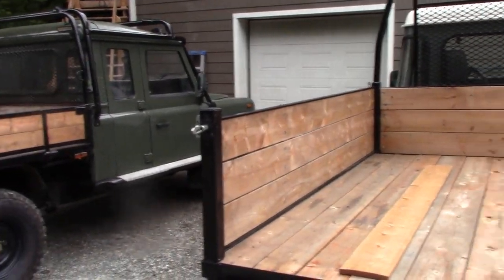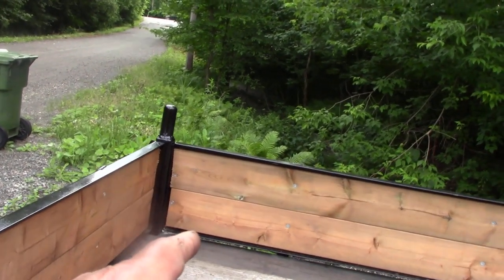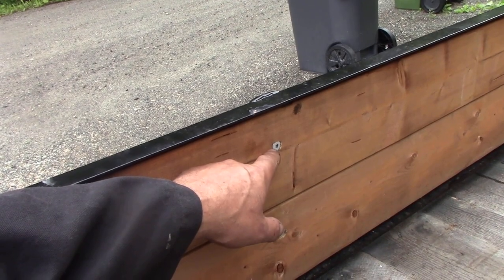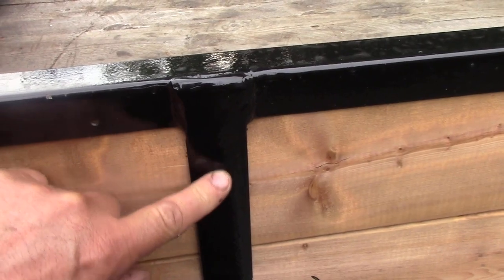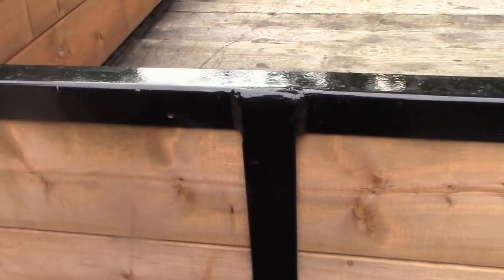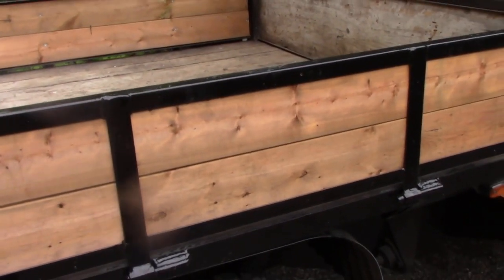The secret for attaching boards: I used self-drilling bolts with a drill tip on the end. They were far too long so what I do is cut them down, drill through the bars, buff them off as flush as I can, then once painted go over it again with a bit of paint to cover the thread - otherwise they'll be silver dots everywhere and go rusty.